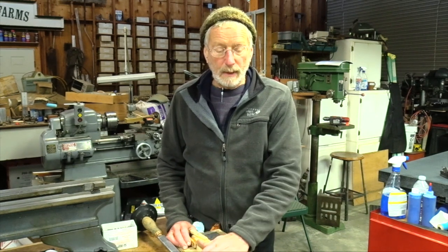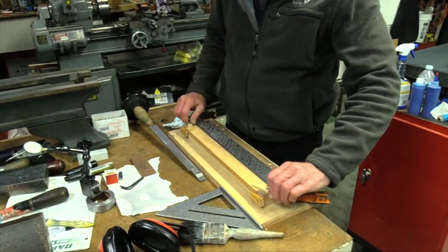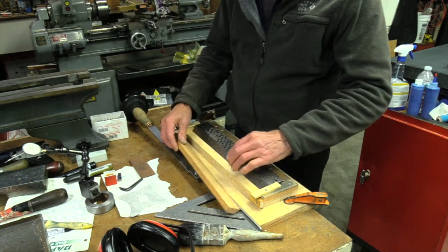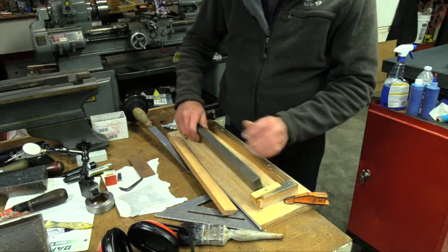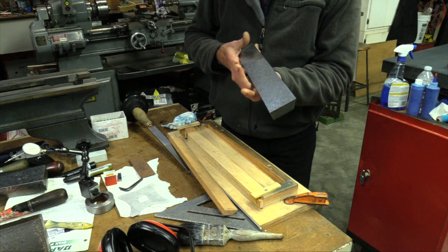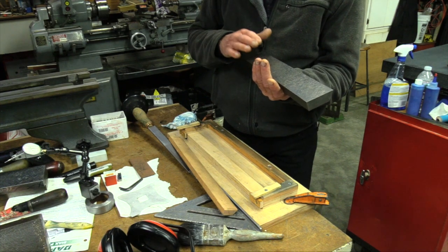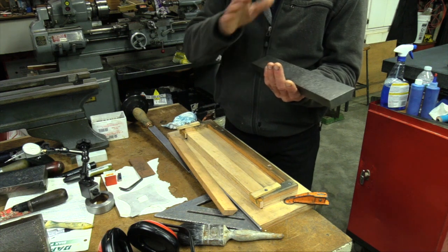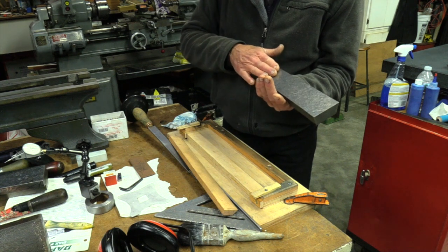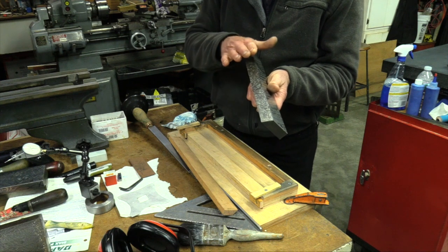My project, I brought this, it's a cast iron straight edge, and I had started it at home on what I call the A side, which will be the actual straight, flat side that will be used as a straight edge for transferring the blue. Eventually this will be the reference flat, because you can't take the surface plate to a machine, and then it has a 35-degree angle on this edge, which I'm scraping in.